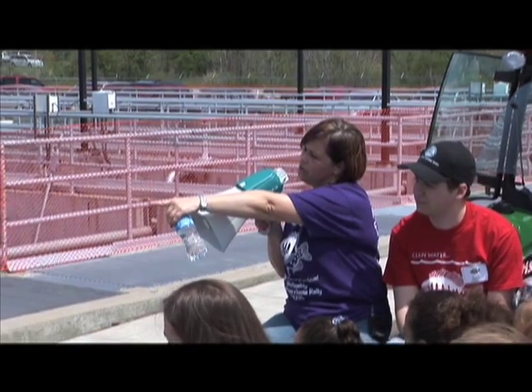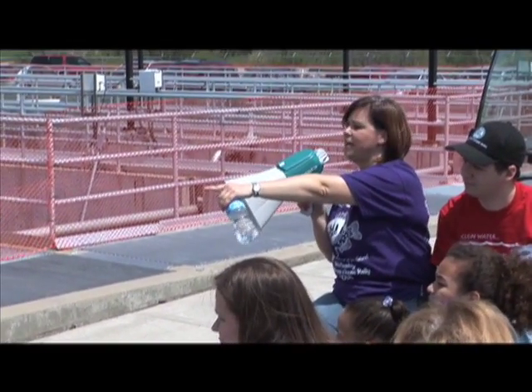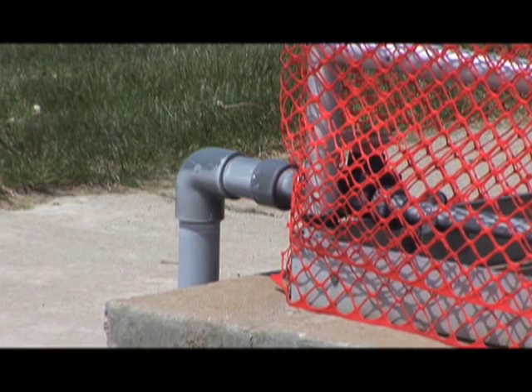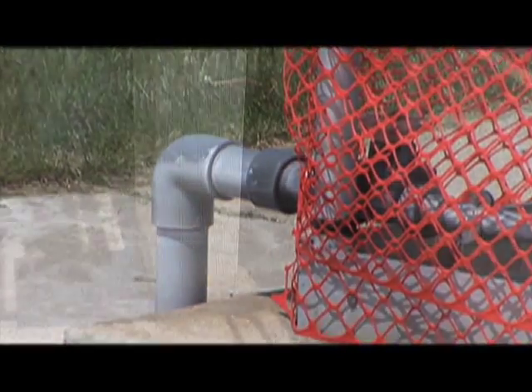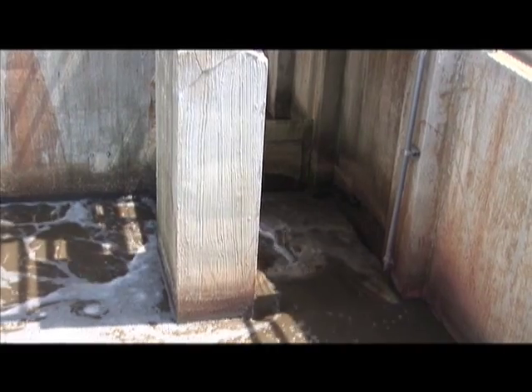If you want to jump off, you can look down and see them. In this very corner here, you can see that gray pipe — out of that is coming ferric chloride, which is a form of chemical treatment. We put that in there to remove phosphorus. So far we've had physical, biological, and now chemical treatment. They're going down the drain right there to go over to these tanks — we'll see where they come out.